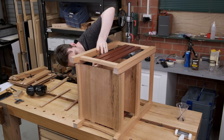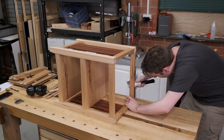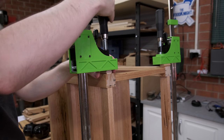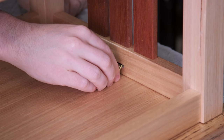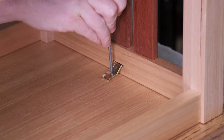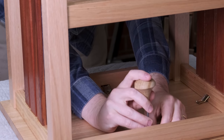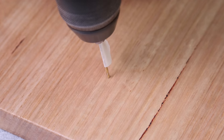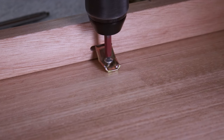The shelves are floating — they do not get glued in. I found these parallel clamps have enormous clamping pressure so some scrap wood makes a good caul to avoid denting the wood. After the glue is dried, with the table upside down on the tabletop, I put the Z-clip in the slot and mark where I need to drill. Ideally you don't want the clip to be completely bottomed out in the slot so there is plenty of room for movement. The frame is removed so a pilot hole is drilled to a set depth, then flipping the frame back onto the tabletop the clips are screwed into position.